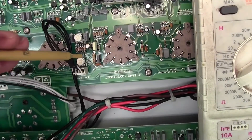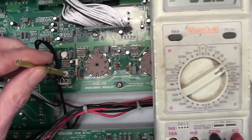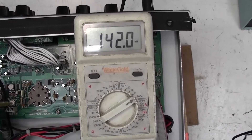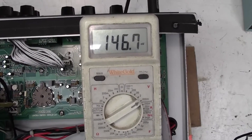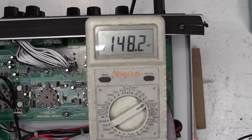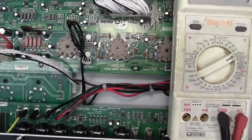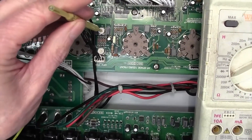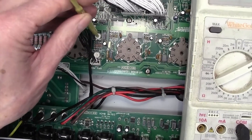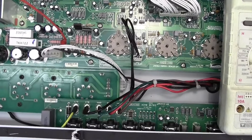I'm going to go in here to this bias pot — clockwise gives you more current, anti-clockwise gives you less current. I'm just going to turn up the current now to get about 140. Don't sweat a millivolt here or there — don't even sweat 5 millivolts here or there because this is the current going through four tubes. So 147, 148 — that's perfectly okay. That's about 35 milliamps per tube and that's it, job done. This other pot is for balancing the two halves but you can only do that if you've got two bias probes on the other side of the board and you can monitor the current through both halves. Other than that, just rely on the fact that your supplier has given you a good matched quad of tubes.